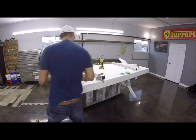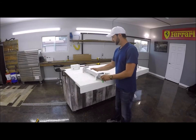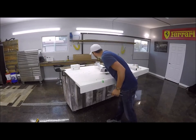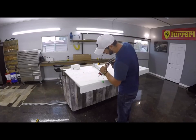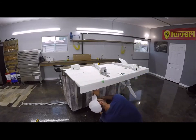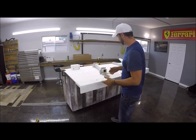There we go. I'm going to grab the air gun and clean this off. I have everything cleaned off — I want to make sure everything is nice and clean. You're going to want to use marine sealant for these holes because you don't want water to get in there and rot your platform. 3M 5200 or 4200 works excellent — it's really up to you what you decide to use. Don't be shy with this, use lots, it's okay if it makes a mess. I'm going to put some on the top side and on the bottom, making sure it's perfectly sealed. Squirt that in there, and you're going to do that for all four holes.